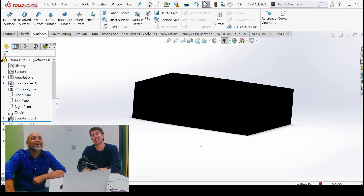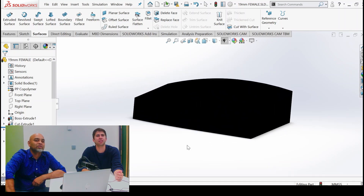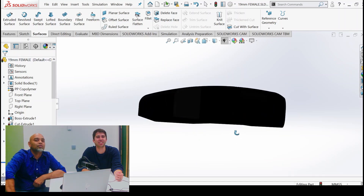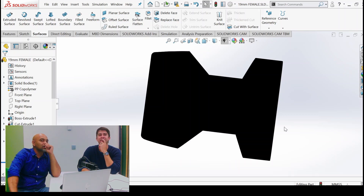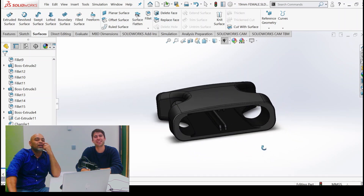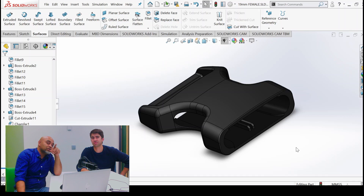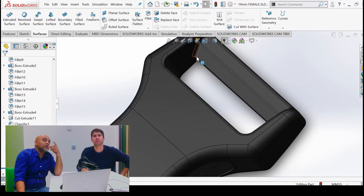Going to play again — Guess the Part. This is really fun. Oh, you're not giving much away. What is this big black box? Can we rotate that? Is it just rectangular? Hello — it's got a little bit... The black doesn't help because you can't see the detail. Almost like it fits in your palm — maybe a mouse? Oh, he's gone and did the fillets. Oh there we go — this is one of the buckles, the snap buckle. Well done! We ran this as a project — the male and the female part. This is one of the nicest things you can do. There are lots of fillets on the bit that connects to the belt. If you don't put those fillets in, you're going to have stress concentration and that's where it's going to fail eventually. The roundedness is necessary for the longevity of this. Fillets — we love them. Remember your fillets.